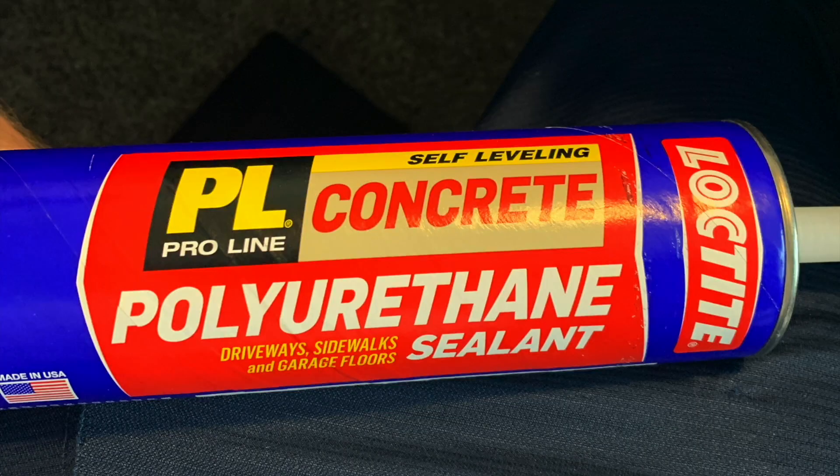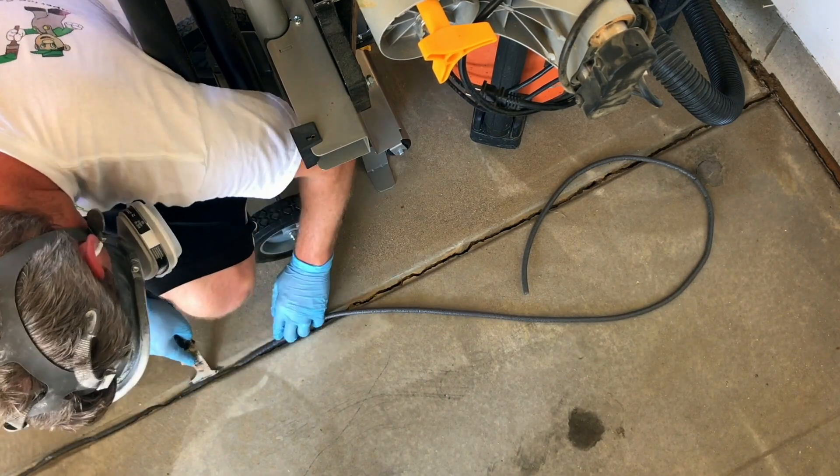Since I had my floor mud jacked, I was worried about moisture evaporating from the wet mud. A test you can do: take some plastic, cover all sides with duct tape, come back in a few days and make sure there's no moisture underneath. There was none for me.